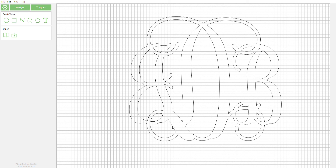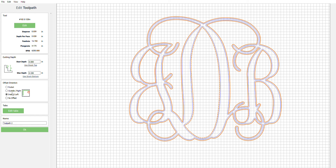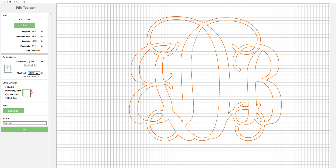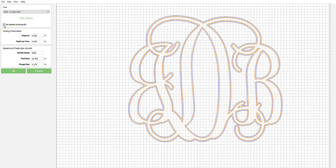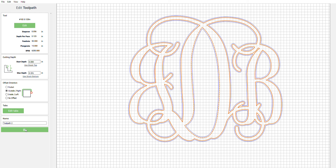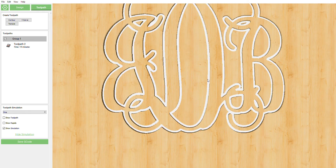It took a little bit of work drawing all those little arcs to save our desired settings. But now we can just go ahead and come over to toolpath — might as well finish it out and see what it's going to look like. The max depth on this piece is set at 530, so we're going to go ahead and delete the zero and hit 531 so we go all the way through. Setting this like I'm running some hardwood here, I'll do conservative this time — 15. That gives us a decent time: 19 minutes. Everything that we want is going to cut out, so let's see what it's going to look like. There we go.